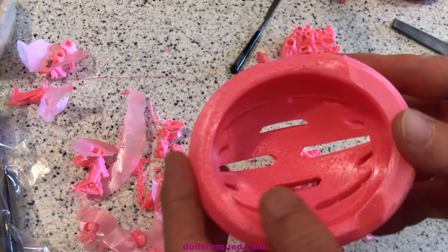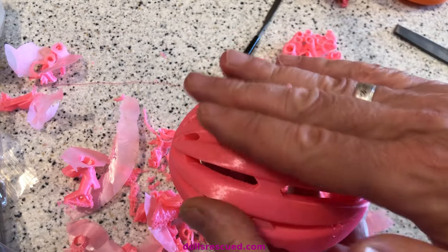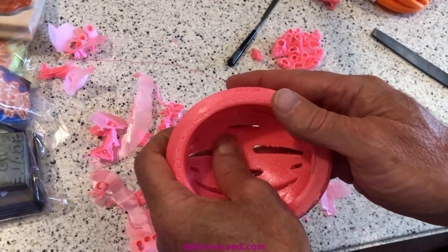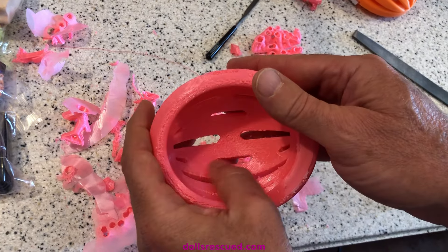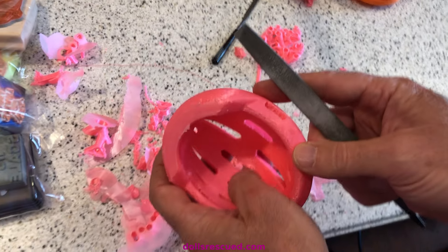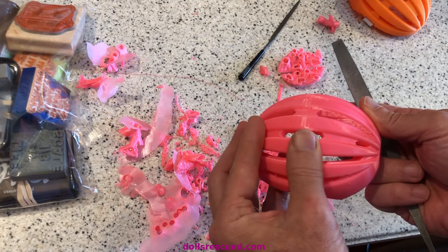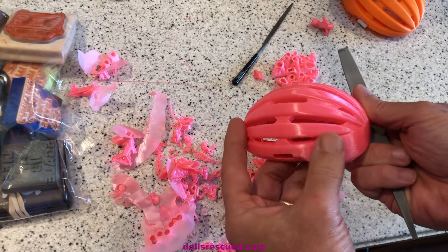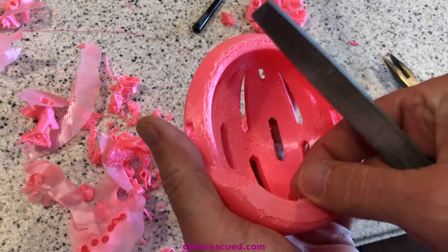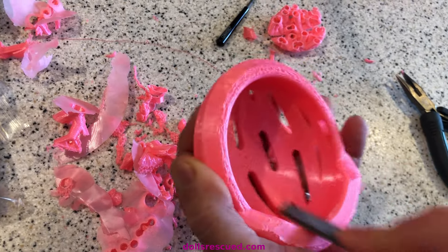I've pulled all the support material off. Down in here is obviously the inside — when printed there would be a lot of support needed, and it's pretty rough. I've smoothed it out and knocked off most of the burrs. The next thing is filing. The downside of filing is it's not like wood — this nice shiny texture will be gone if I rub a file over it, it'll just be a rough surface. I'll knock off the base material here with the big file.